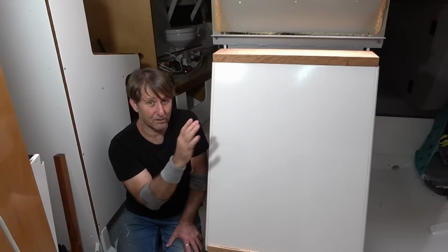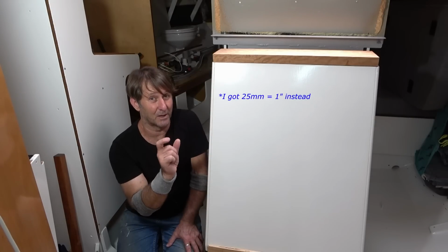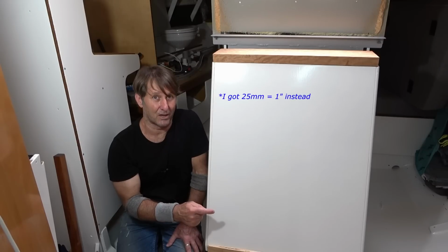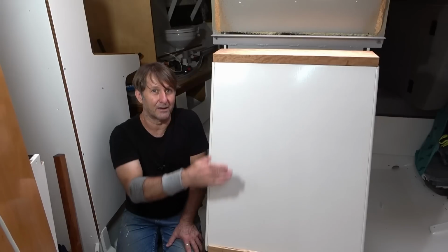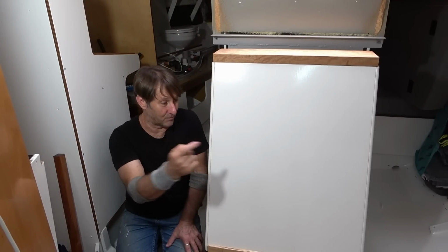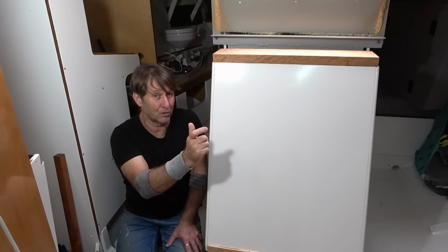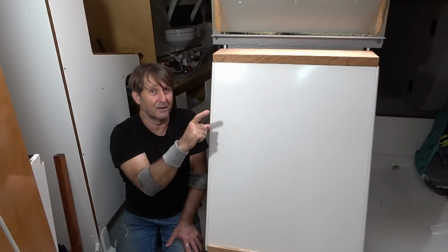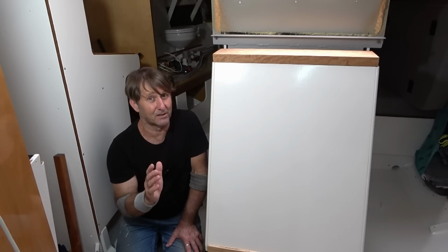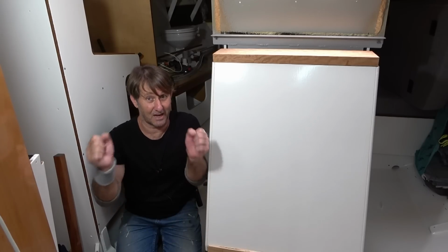And then once those steps are in place, I'm going to be having some probably 20mm diameter stainless steel tube meet that first step and be fixed to it, and then run at the same angle as the box. Where it meets the steps, they'll be fixed to the steps so that each of the outer edge is supported as well as the back edges. It will then change directions and be fitted to the top of the box. And an added consideration I had was that that tube also adds as a hand grab.